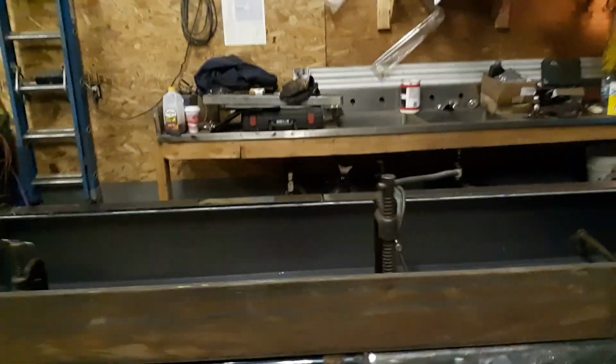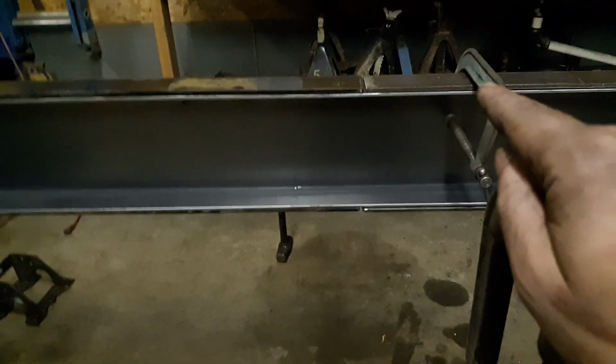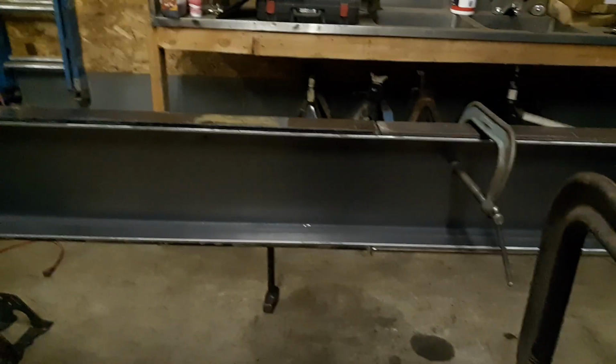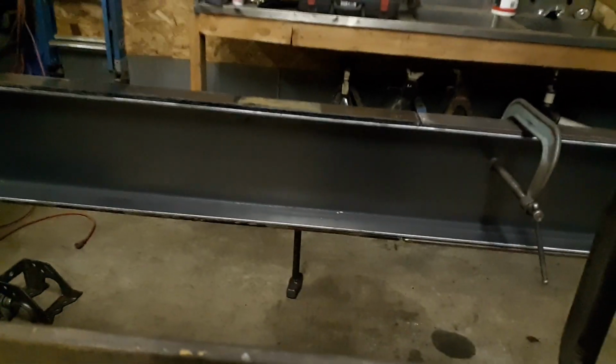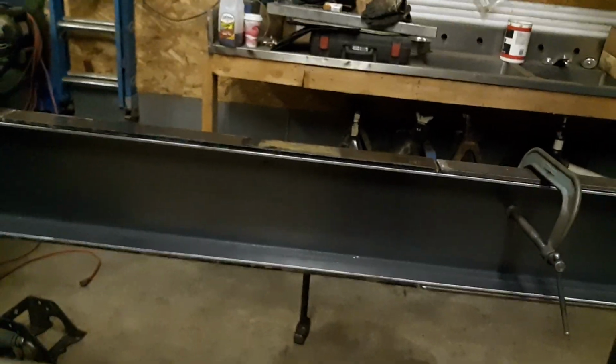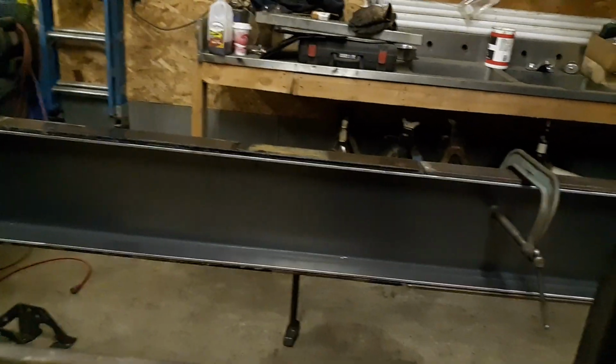then after all, we're gonna weld this on the outside, weld that main frame up with the insert in place and clamped up tight, and that will pretty much get everything level. It's not going to be perfect with that. We're still going to have to run a straight edge across the top or a string, something like that, to eyeball down the frame to get everything perfect with the jacks. Weld the outside of these joints here in the main frame.